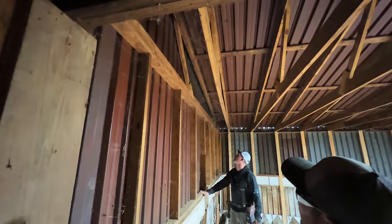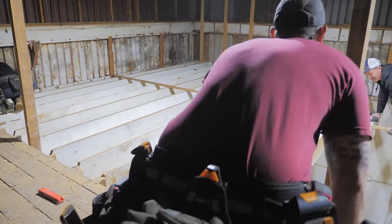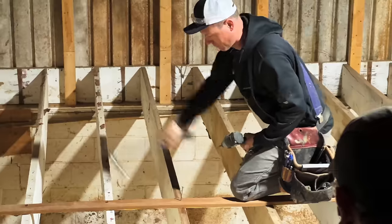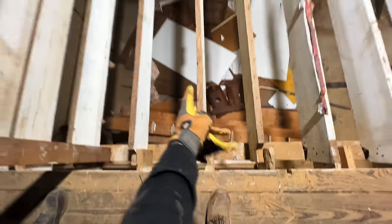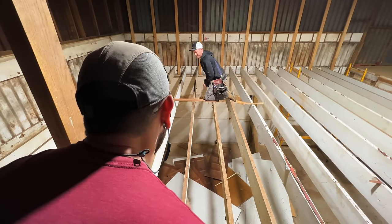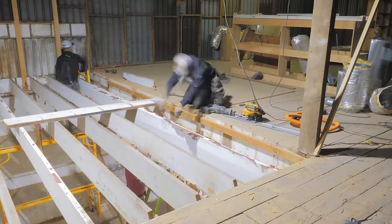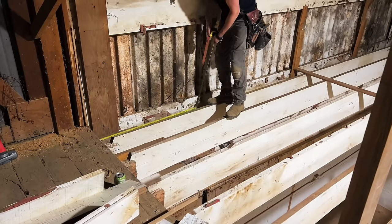Back to the floor — the first thing we did was add a few layout boards to lock the joists in place, which allowed us to straighten them using a line laser prior to installing the plywood. We also added the last missing floor joist, scabbing together two shorter floor joists since I couldn't find 20-foot-long 2x12s locally. Now that all the joists were in, we could start the process of getting the plywood decking reinstalled, beginning by snapping a reference line for the sheets.